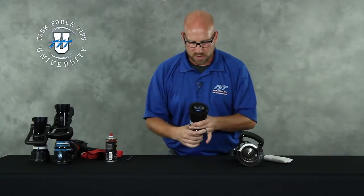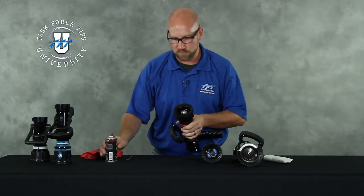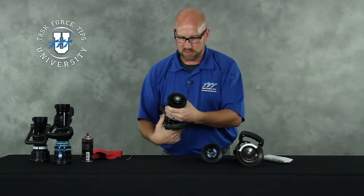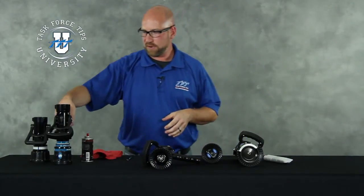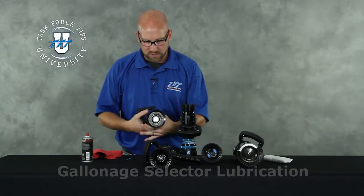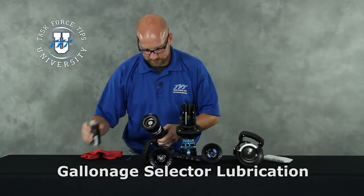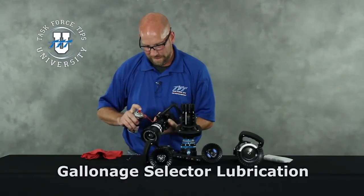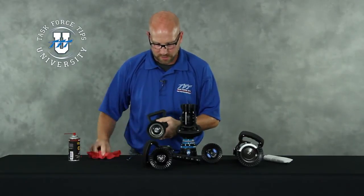The combination nozzles throughout the line are pretty well the same. You can see we have an inside diameter here to spray. This is a dual pressure fixed gallonage Metro nozzle — same thing, a little bit around the inside diameter. Many of the points in these cases are the same. If you have a nozzle such as the G-Force or one of our selectable gallonage nozzles, there will typically be a selector ring that rotates. Anything that rotates is a good candidate for spray lubrication — a little across the front as well as on the back side. Then just operate that back and forth, wiping off the excess.